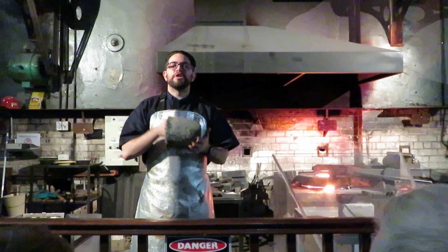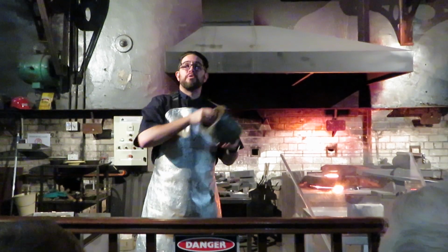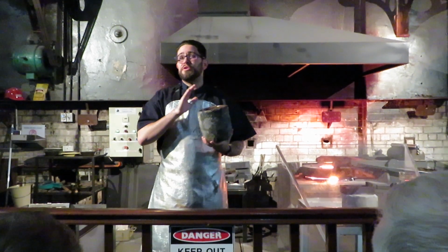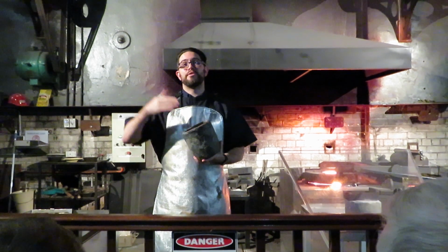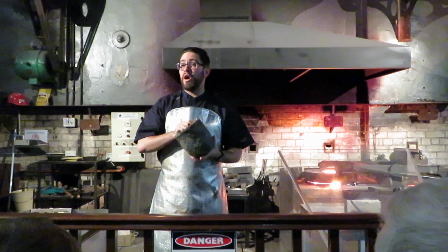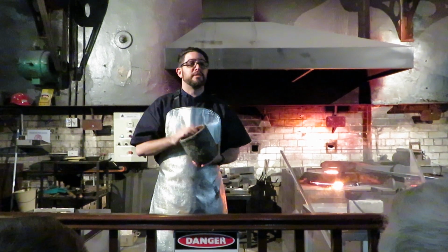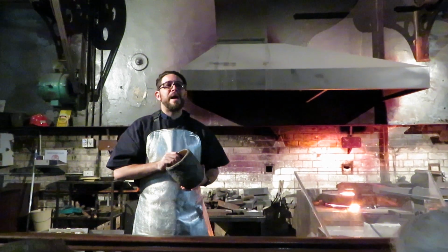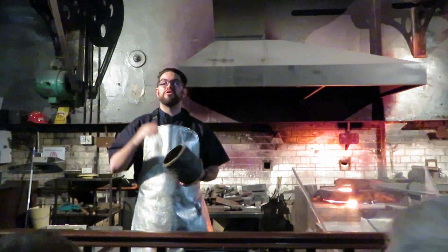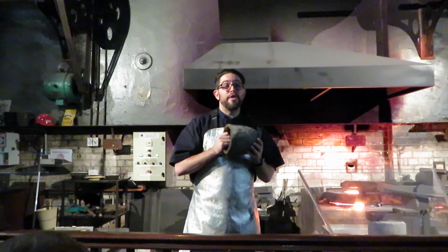Well, we actually do a few things first. So instead of just throwing them straight in the bin, we send them off to the refinery first, because after 2 weeks of use, the gold we've been pouring has started to stick. It starts to work its way into the material of these pots, into the cracks and crevices. We get all these lovely little gold nuggets being deposited. So we send these pots to the refinery for processing. They send us back around $200 up to $600 worth of gold from every pot. So it's definitely worth getting that done.